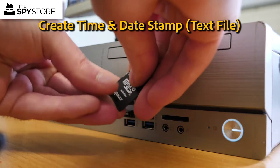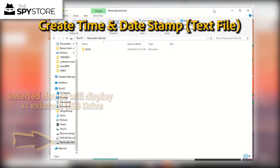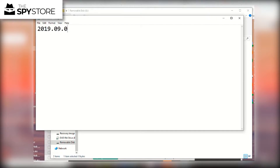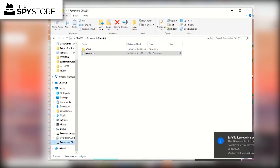Alright guys, here we are with the Lawmate text file that we need to create to alter the time and date. If you're in a state other than WA you'll probably need to alter this when it gets to you. All you want to do is right-click, select New, and create a text document called 'settime' — all one word, all lower case. Make sure your micro SD card is the one inserted into the computer when you're doing all this, otherwise it will be null and void. Then double-click on settime and enter the date by year, month, and then day with decimal points in between. Leave a space and enter the time — for example 11:39 and an amount of seconds. Make sure you click File then Save, and then File and Exit. If you just close it, it won't save. Eject the card and you're good to go — that's how you create the time file on the unit.